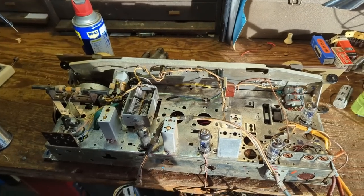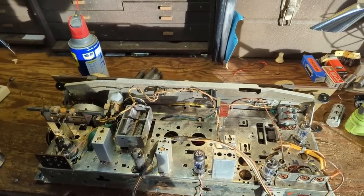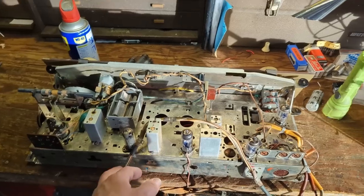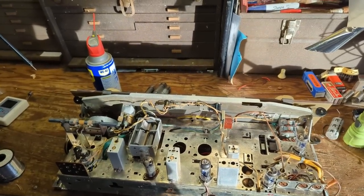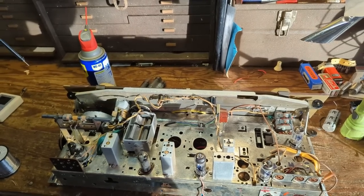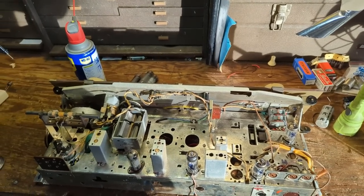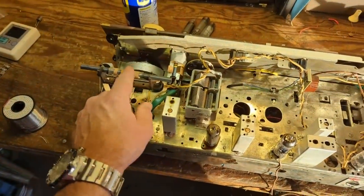It's time to start working on the second chassis — the tuner chassis. I took one look at it yesterday and thought that does not look fun. There are close to 20 capacitors in here that need to be replaced; they're all paper caps. The caps that came out of the amp and power chassis looked awful — a lot of them had melted open — so I suspect there'll be some equally nasty caps in here. I'm going to flip it over, being careful not to rest it on anything fragile.